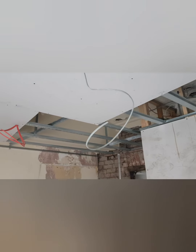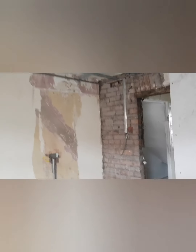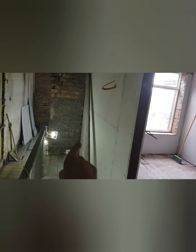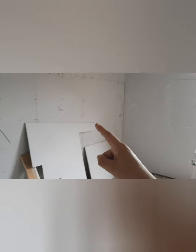The feedback was yes it's added cost, but by the time they've gone and pulled the floorboards up and knocked out the joists, it's just time and effort. It's quicker for him to just drop the ceilings and let the plumbers, sparks, and electrics put all their services in the dropped ceiling. So bedroom 6 will be in the loft, bedroom 5 is behind me, this will be bedroom 4. We've put acoustic mineral wool in the walls - I've seen some people don't do that, but this is going to be a bedroom, you try and keep it as sound as possible. What you don't want is someone sneezing and you're hearing it blatantly outside. We try to give the tenants the most comfort and keep it as quiet as possible.